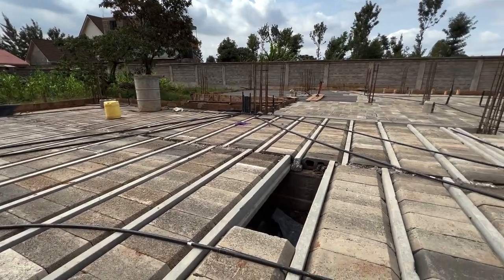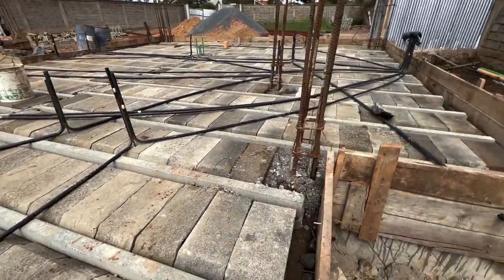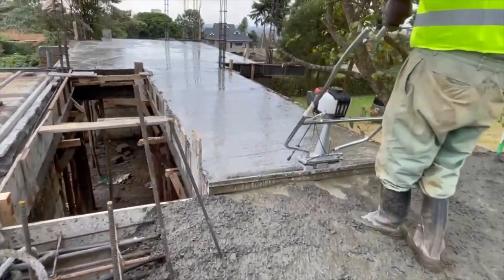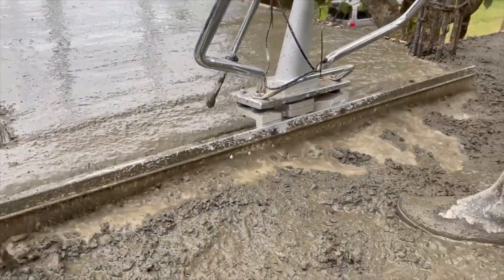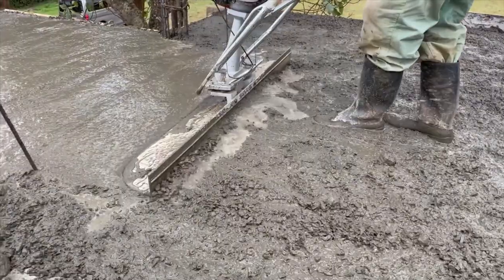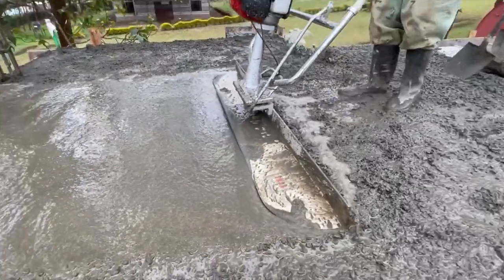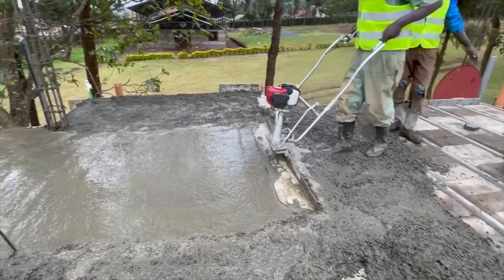The concrete acts as a binder to hold everything together. Before pouring, you grout the surface with sand so the blocks and concrete can bond together to create a monolithic surface. We only need a 50-millimeter topping — this is where the big savings occur. In the traditional setup you do up to 150 millimeters of concrete topping, but with beam-to-beam flooring you only need 50 millimeters.